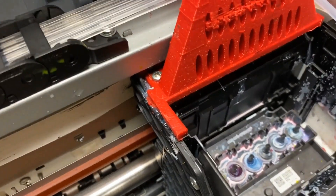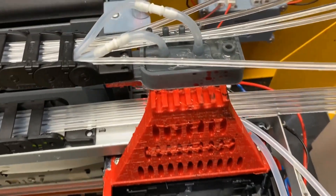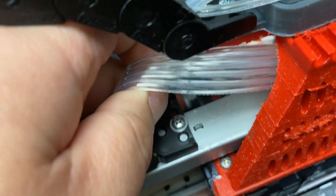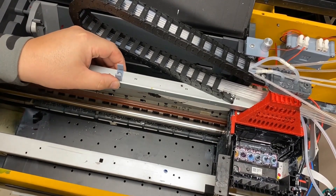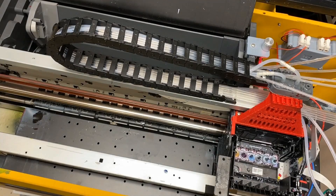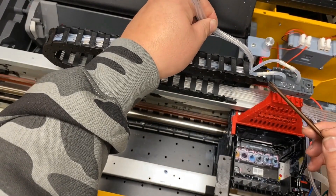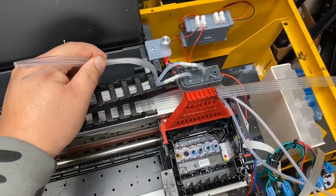Then I put the right booster plate on the print carriage. It's necessary to have a booster plate because the drag chain is higher than the print carriage. For the drag chain, you can directly screw it on the rail, and then in the middle you want a clip to stabilize the drag chain on the rail. This assembly is called the printed management assembly, or PMA.